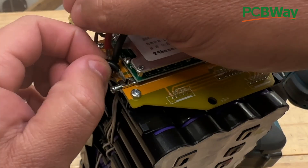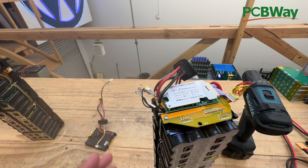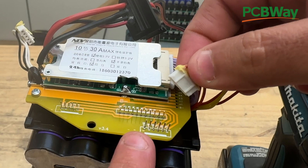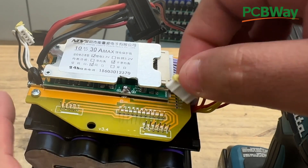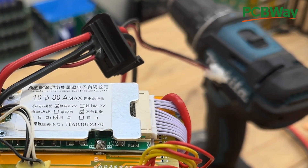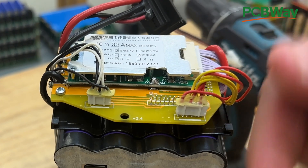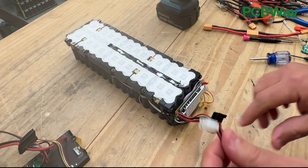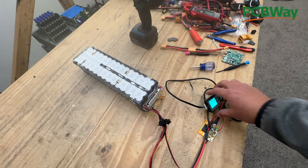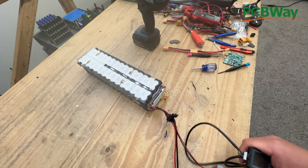Now the black one. Next, the wires — this is a six-pin connector that goes in here. The little mark on it indicates the correct orientation. And there are the wires connected — the two little lines go towards the bottom of this board. Next, to wake up this BMS, you might have to apply power into the charging port. In our case, we just plugged in this meter here and it came on, so we didn't have to do that.